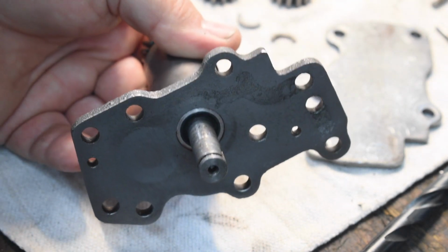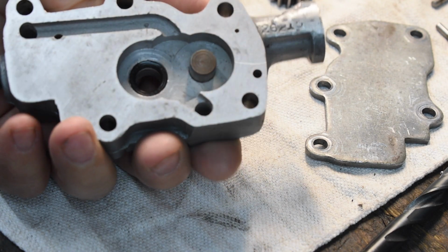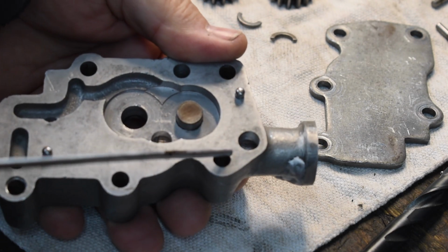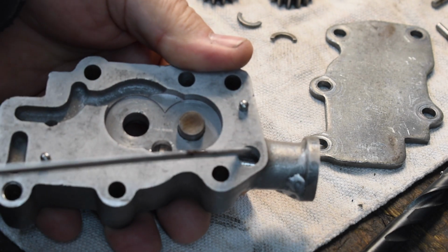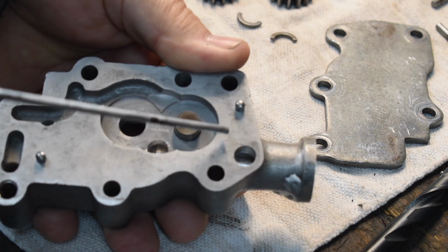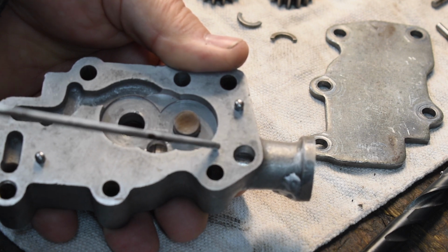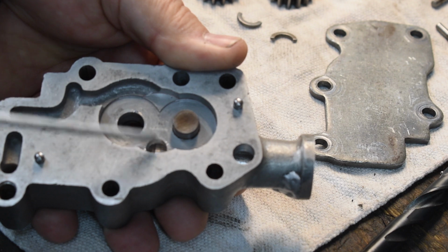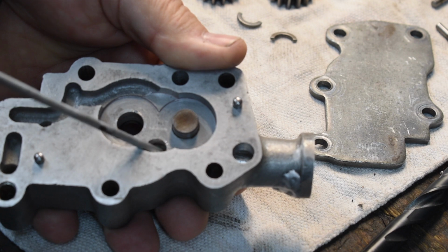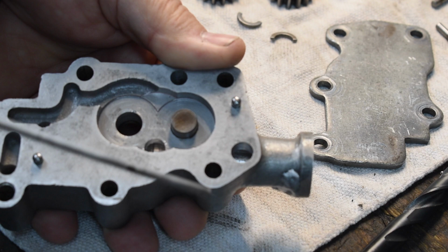The problem is with this pump body. When I had it set up in my test rig, oil was oozing up out of this hole right here. Well, the check valve was right down in this area. The problem, I believe, is that this seat is chowdered up and the ball was not sealing correctly, allowing oil to leak through here, bypass the gears, go through this hole and ultimately come out over here.